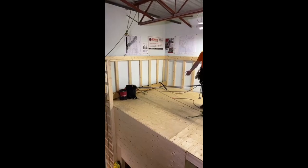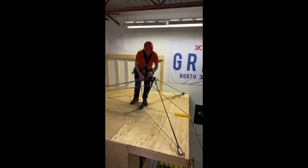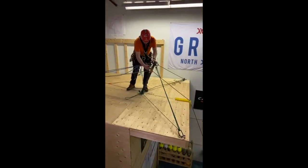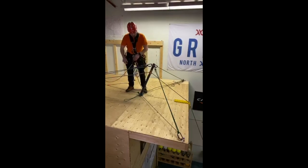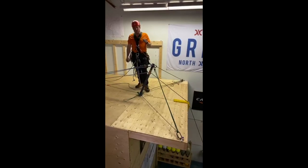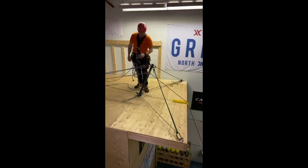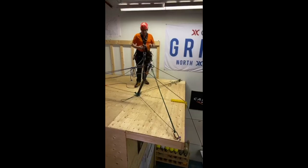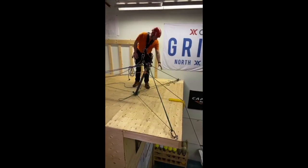In this case we're using a Rock Exotica Aztec 4:1. Four-to-one setups are great — they're quick, they're simple, and I've got lots of mechanical advantage. If I apply tension to this 4:1 I'm going to pull this AHD back, and I might want to do that after I've done the front ties to more closely align the resultant through the pulley and the leg of the monopod. The downside of using the 4:1 and the green cord though is these are equipment-intensive, heavier pieces of equipment, and they're both actually overkill because we don't need a lot of force.